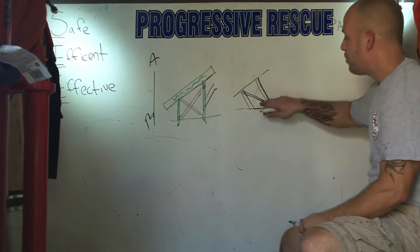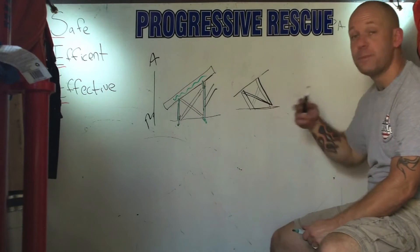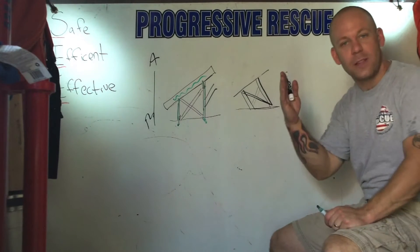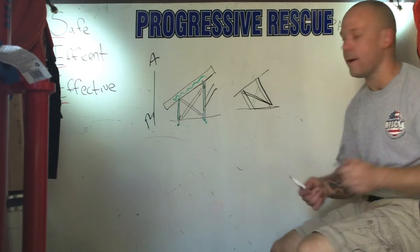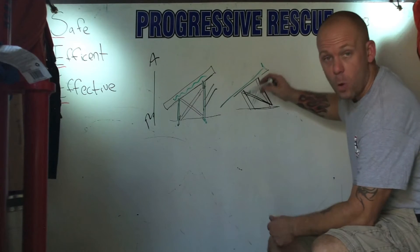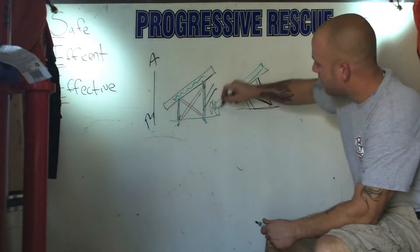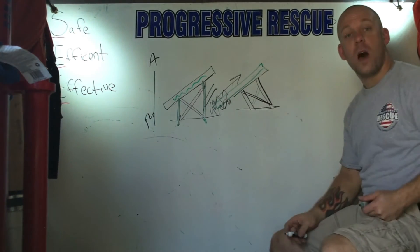So now, for the second type we talked about, which would be a Type 2 Class 3, you'll notice the uprights are angled. You might look at this and say, what is that? They're not plumb — what's the deal here? Well, it's actually pretty simple. Here's our same slab or load we're supporting. Only this time, we have debris and it's pushing horizontally.